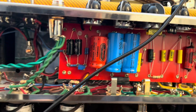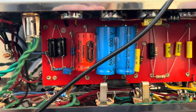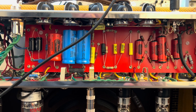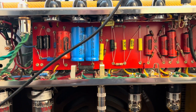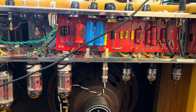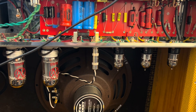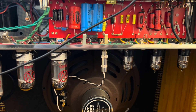I'm going to go a little lower here, take it to 20 hertz with the volume absolutely pegged, running about one volt into the input. All right so 45 minutes later — absolutely tormenting the bright channel and severely taxing the power amp. Made our way all the way up to 1kHz. Now we're up to 200 hertz on the normal channel. Walt, this is for you buddy — update soon.